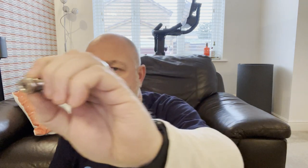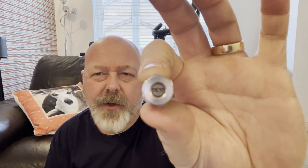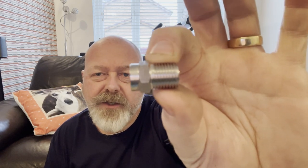I've started to think about the steam condenser. I mentioned in a previous video the 4-inch exhaust pipe, effectively, that we can get into a U-bend over the top of the vessel, but I need some way to jet in cold water to provide that condensation to draw the steam out and down. So I've got these little quarter inch nozzles, they're basically like pressure washer nozzles. These are quite small, but I think it's going to be decent enough in that 4-inch pipe.